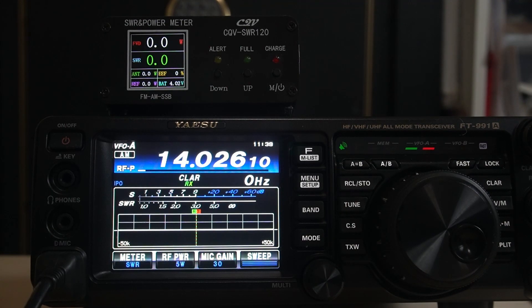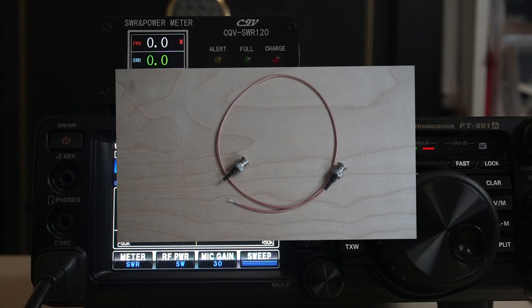I had to let you know that I already found a bad piece of coax using this meter. It was showing me high SWR and I am on a dummy load. I'll show you a picture of that — as you'll notice, the end came off.